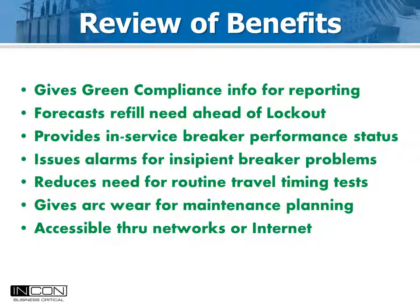The Optimizer 2 offers many benefits. It will totalize the lifetime use of SF6, making EPA reporting compliance easy. It will obviate the need for offline circuit breaker testing. First trip information will show any degradation in performance over time. It migrates the SF6 system integrity function toward the active and predictive smart grid realm.